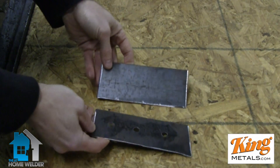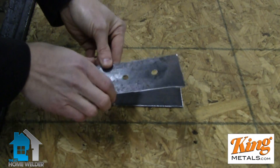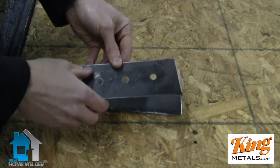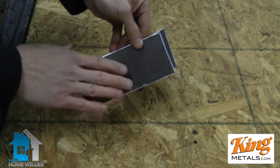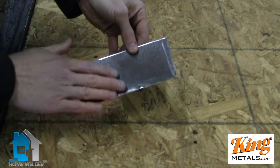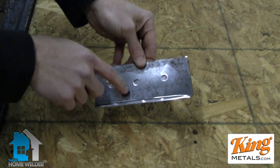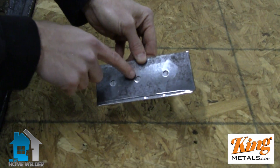What I have here are two pieces of scrap for the demonstration. I've drilled three holes — these are about a quarter-inch size holes, and usually you're going to have holes about this size. If you go too small, the weld just won't be big enough to hold, because we're not going to be blowing through to the other side. We're going in just enough to get good penetration but not blow through, since the point is hiding the weld. We're going to clamp these together and fill in the hole, going in a circular pattern and spiraling out, pushing the weld puddle out over the lip.